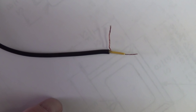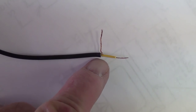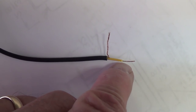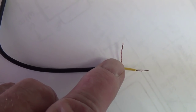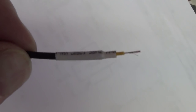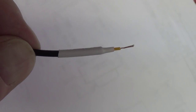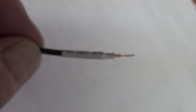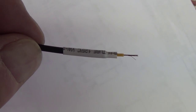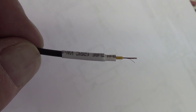Now it's time to install the first shielded cable between the input jacks and the first preamp tube grid. You start by stripping about an inch from the end, then strip the inner wire — this will be the signal — and twist the shield wires into a little pigtail. At the other end, there's no need to twist the pigtail; instead, cut all the little shield wires flush with the outer insulation and use heat shrink, because one hair from the shield could cause a dead short.